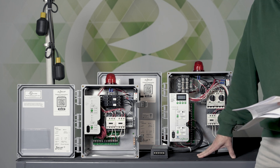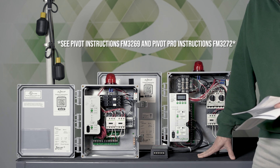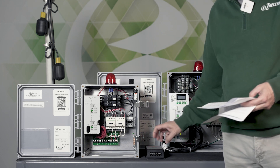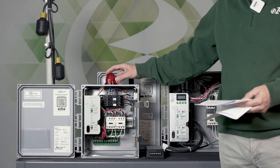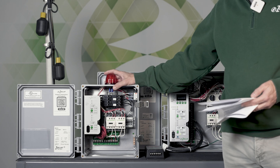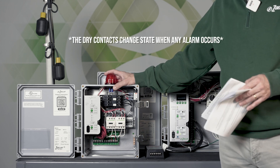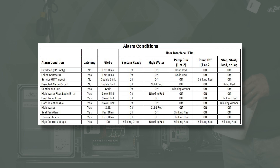You can consult the installation instructions for the pivot control panel to see which alarms will be triggered and use the dry contacts to send an alarm to the APAC. For example, the high water alarm triggers the globe, horn, and dry contacts. Several other alarms are also listed in the instructions — such as a float logic error, control voltage error, or contactor error — which may be useful for your installation.